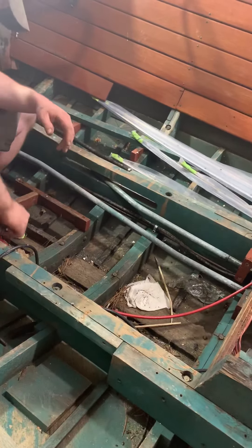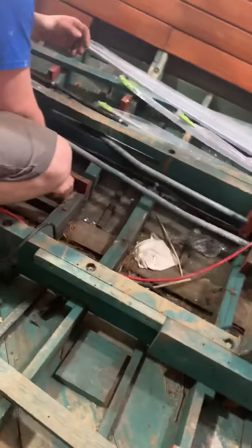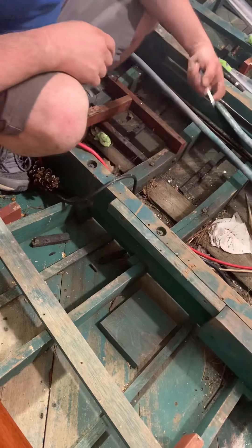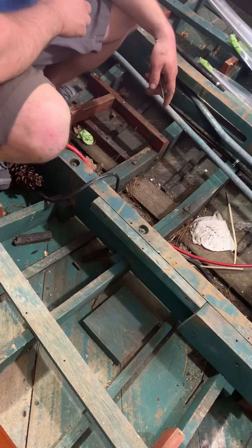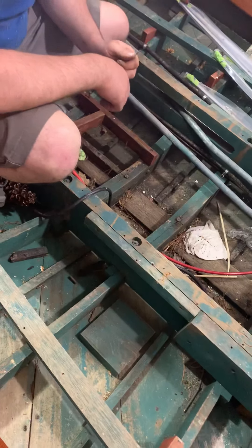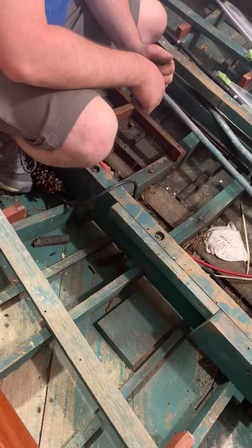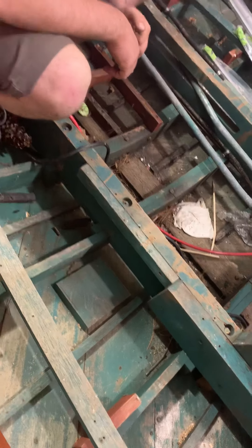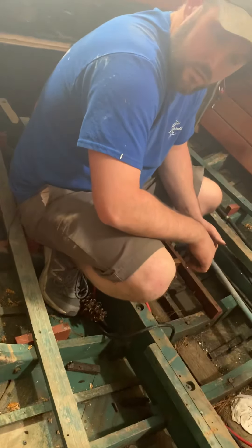Our thought is that you may be a candidate for a new bottom. By the time we fix all these little spots, fix the transom and bow, we would just cut all these intermediate ribs that are rotted — cut the rotted part off, drive those screws back through, and they clamp the two layers of the bottom together, three layers if you include the canvas which is probably pretty well rotted out. So we've got these frame problems, the intermediate problems, and there's something going on with the gripe. I'd say within five years you're going to have to do something up in front.